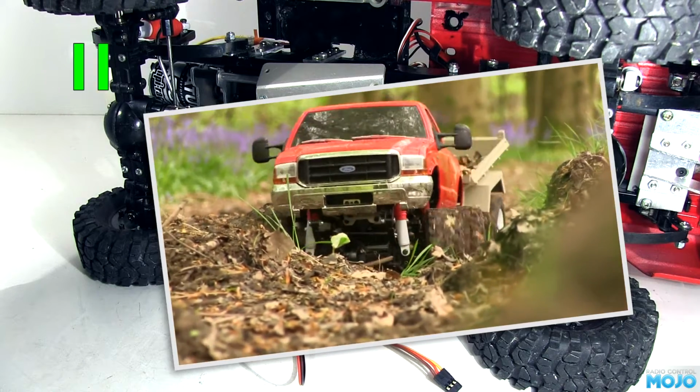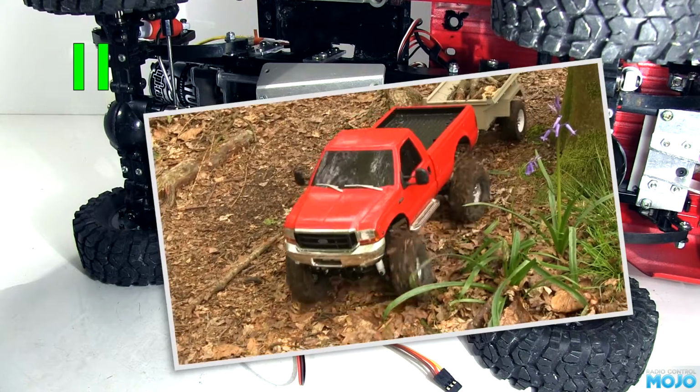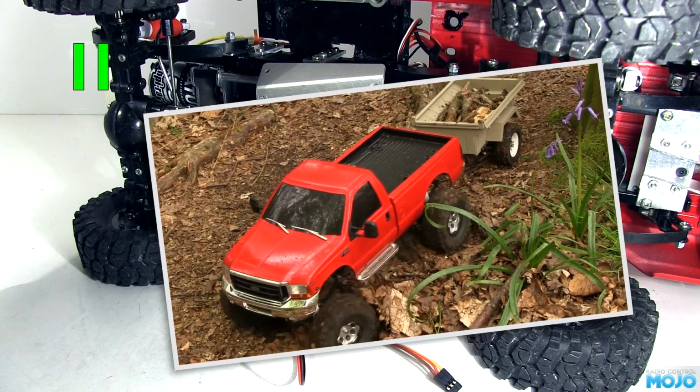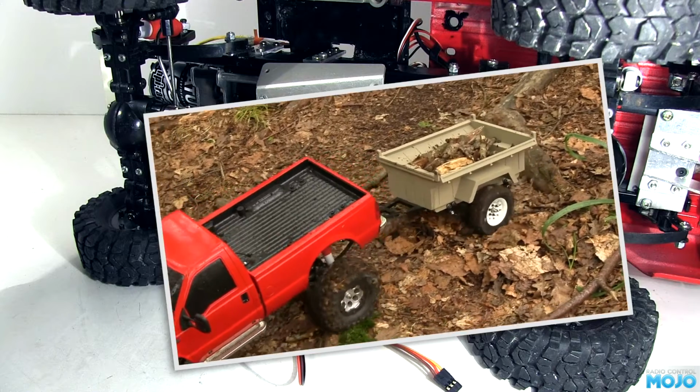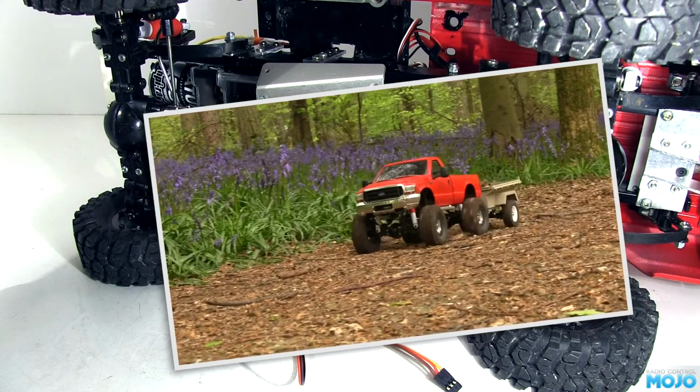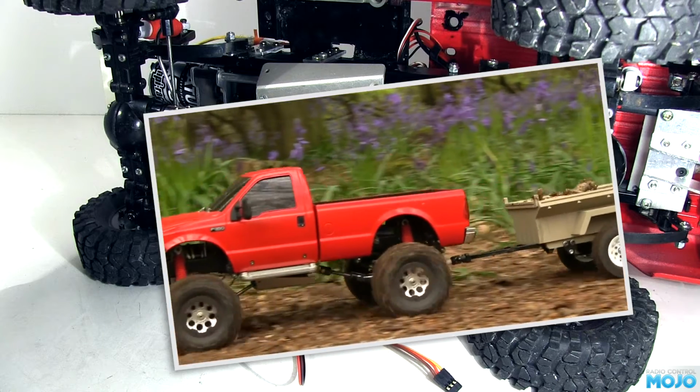The servo should jump to its midpoint. Ideally, you want to mechanically adjust the servo arm and push rod so the gearbox is nicely seated in second gear. If you disconnect the linkage, the rod that goes into the gearbox should spring to the right position for second. You may need to rock the wheels a bit if the clutches don't want to engage.